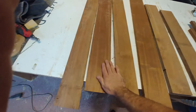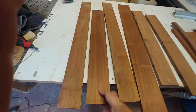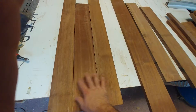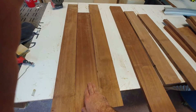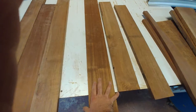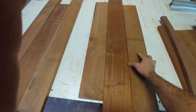I found this piece of mahogany — and this piece of mahogany — I was just lucky they're really nice quarter-sawn pieces. I want to sandwich this mahogany between two pieces of black walnut. They're a similar tone, but when you finish it the figuring and color will stand out a little better. They make a nice complementary pair of species. So if there's a shelf here and a shelf here, I'll put the mahogany in the center.